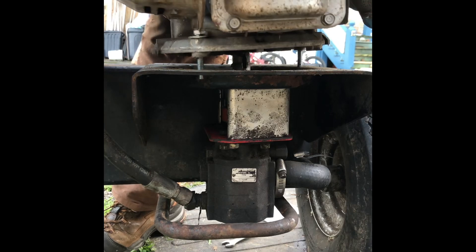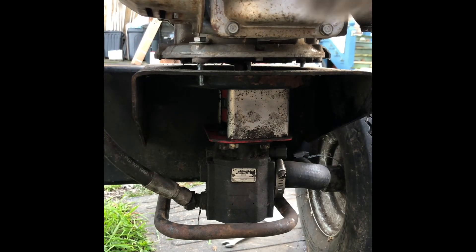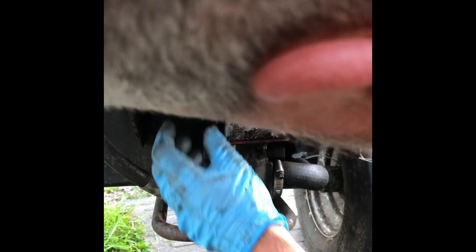This spider should be close to where it left off. I had to loosen up the set screw here so I could allow the coupling to slide up on the shaft for everything to fit properly. Now we're loosened up — perfect. Now we'll put our bolts in and tighten up. The part I didn't show that well is when those two Lovejoy couplings come together, you want them seated on that spider so they're solid — not squished, and not too much gap. So those two pieces come together onto that middle rubber spider. I had to play with the adjustments on the set screws on the shaft between the pump and the motor to get them right into the sweet spot. I really cranked those set screws tight.